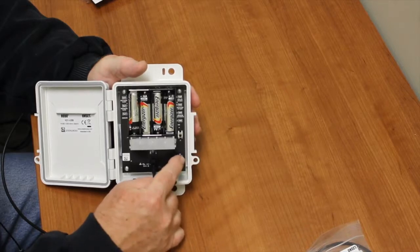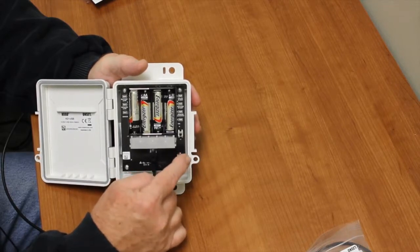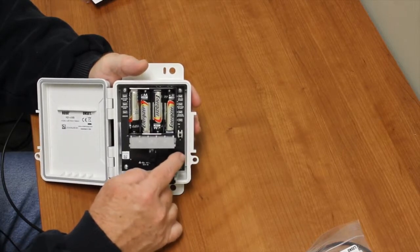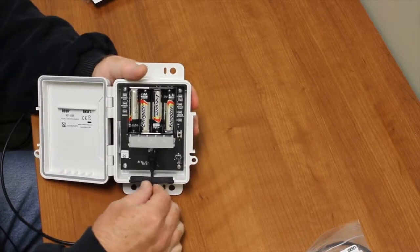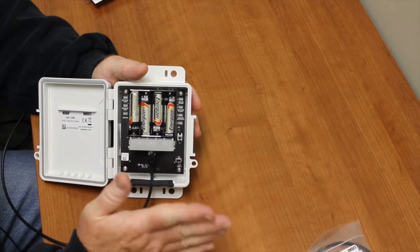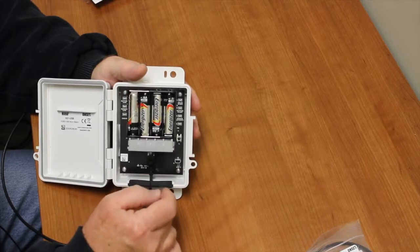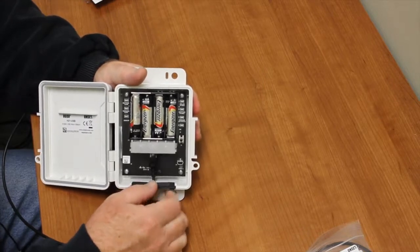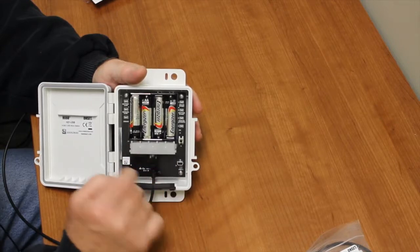Here's the USB port. Keep in mind there's a driver that needs to be loaded. We're emulating serial with this logger, so there is a standard driver you'll need to load just once when you first purchase a new logger. If you buy subsequent loggers, you don't need to update the driver — you just need the driver on your computer. Newer Mac computers have that driver included. For Windows 7, Windows 8, and Windows 10, it has to be downloaded from the internet before you can communicate with the logger. There's a video on YouTube and on our website that explains how to do that.